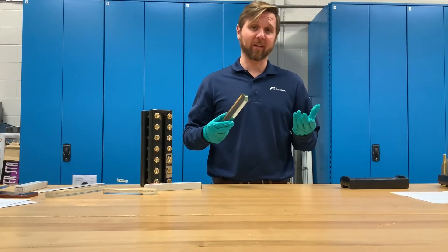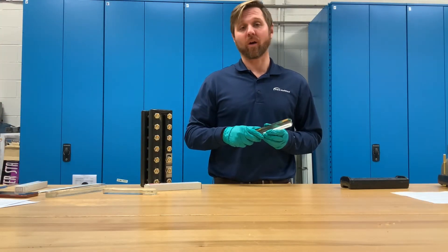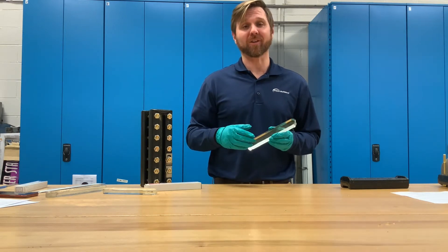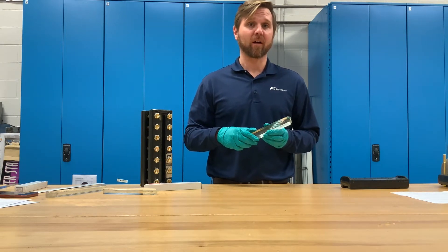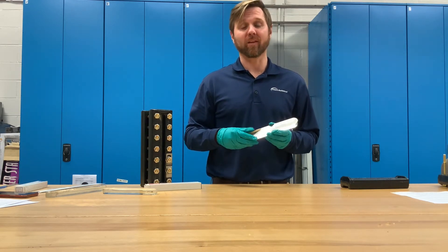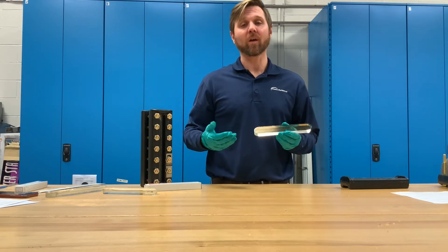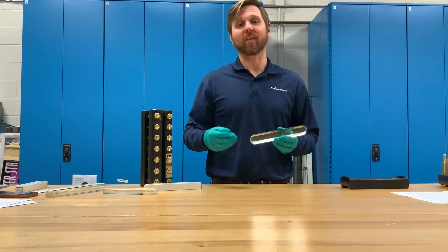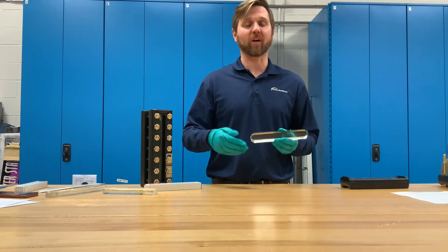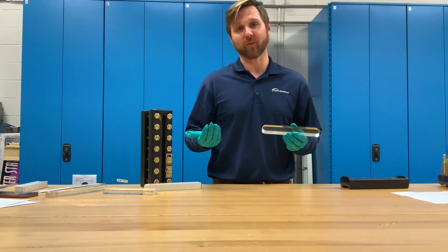When people talk about the service life of a mica shield, water quality, pH, pressure, and blowdown frequency and duration are the main components. Most commonly you'll find that if a mica shield is wearing too quickly, the blowdown is being conducted for too long. We recommend 20 to 30 seconds and then reevaluate it. We've had certain scenarios where customers have blown the gauge down for over 24 hours and the mica shield gets completely destroyed.